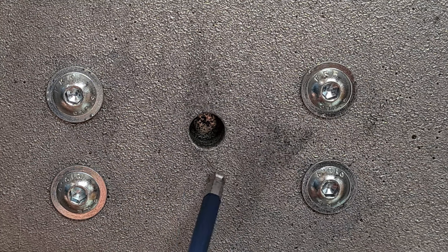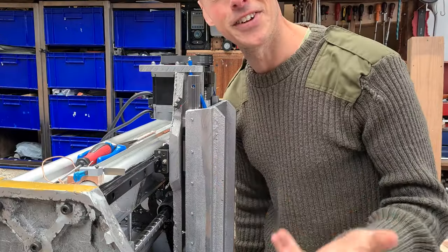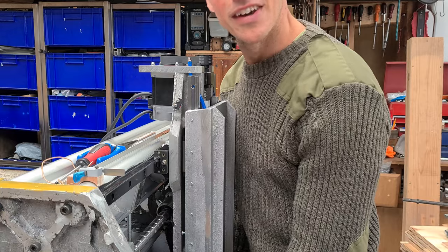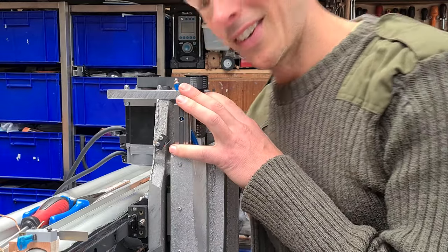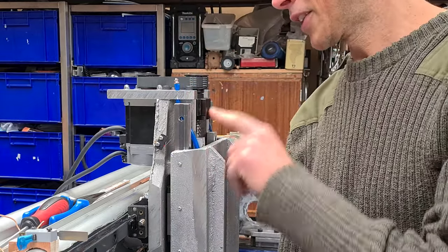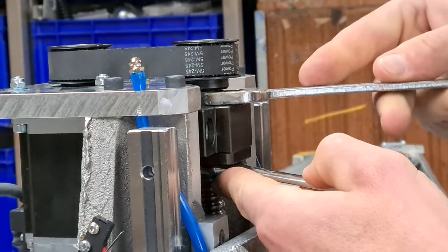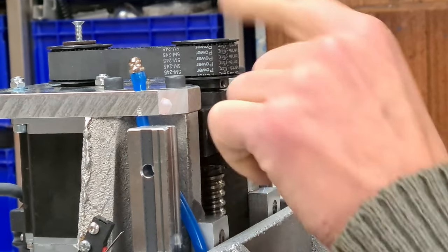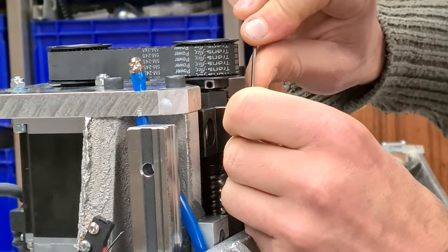You can see the housing mating quite nicely to the plate down there. It's going to give us instant up and down hopefully with very little backlash because it's a nice ground ball screw. Okay serious problem — check this out. I've got half a millimeter of play and it's coming from this bearing block here. You can see this actually moving, so we're going to have to try and tighten that up. Once I recovered from that shock it was actually a super easy fix — just tightening the opposing angular contact bearings sorted that out. Now when I push up or down on the plate it actually rotates the ball screw, and we can lock that preload in just with the grub screw.